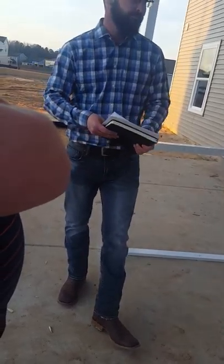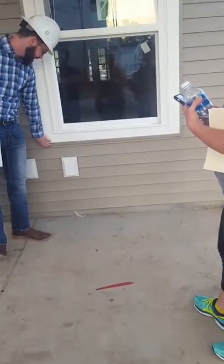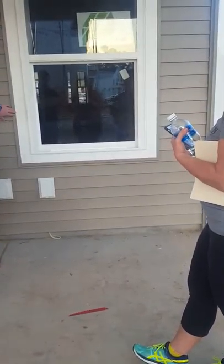It looks like it's frowning a little bit on the left bottom. Yeah, it is. Exactly. And that's exactly what we would be pointing out on that inspection. That's not something we would accept. So no, absolutely not. That J channel has to get cut shorter, and this J needs lifted up.